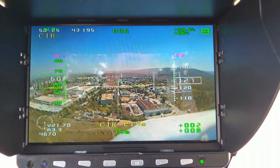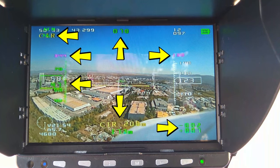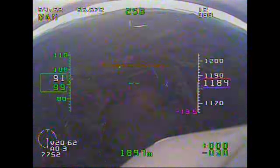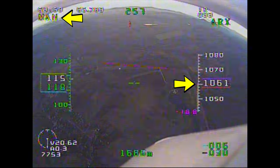One new improvement of the new Crosshair over the old autopilot is the addition of the color OSD. Of course if you do not want that you can always switch it off and revert back to the black and white one, but I think it is a nice touch as it does make a more noticeable separation between the critical and the not-so-critical information on the OSD overlay. The only situation when the colorful bits will not be that useful compared to the white ones would be when the video signal is very low and the image is barely visible — in that situation white text has higher contrast. But nowadays very few people are pushing the limits on a daily basis, so the color thing would be more than okay for 99% of flights. I generally do love how this OSD is set up and arranged without making the screen too busy.